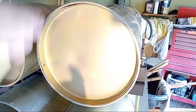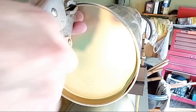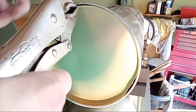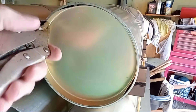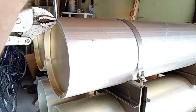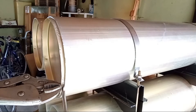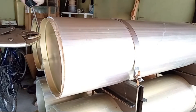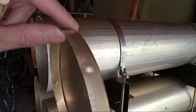With the modified coupling loops installed and a prototype cable harness made from leftover coax, the initial checkout looked very good. I proceeded with the disassembly and removal of the resonator plungers from within the cavities. The bottom of these resonator cans come off and the resonator plungers come out the bottom with this design. The bottom of the can is held in place with a compression dimple — actually three of them around the perimeter.